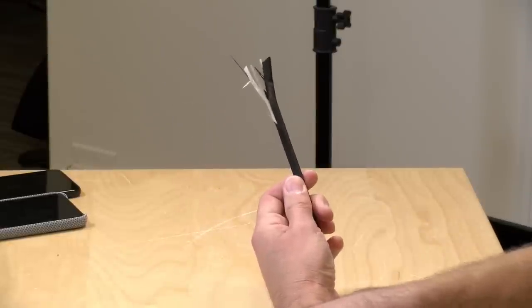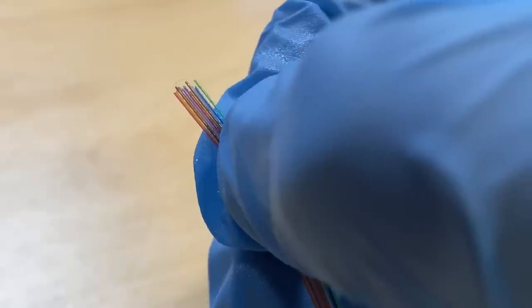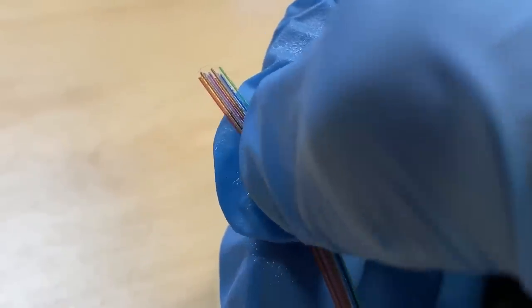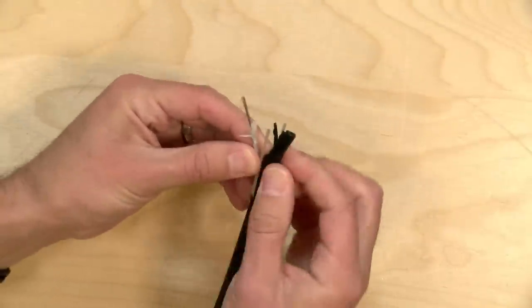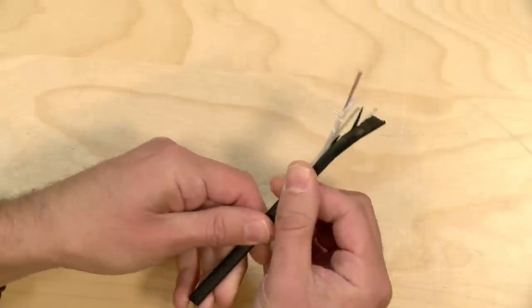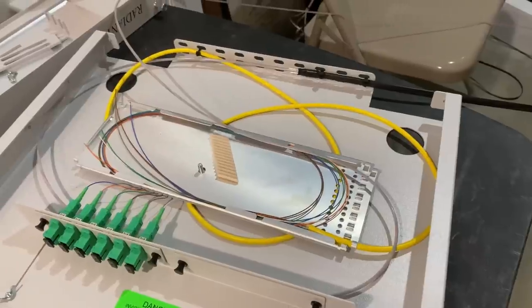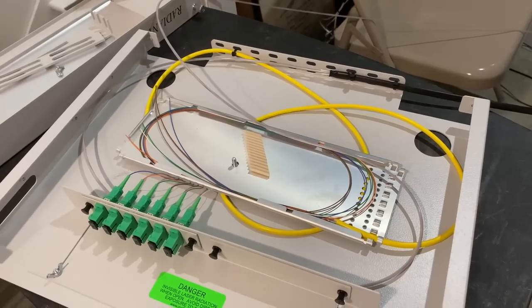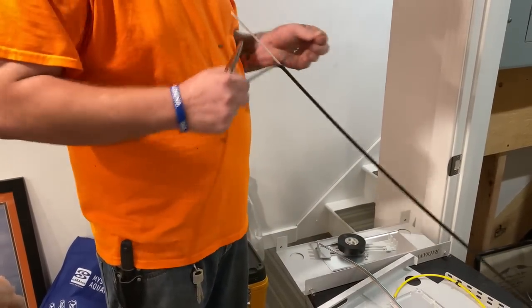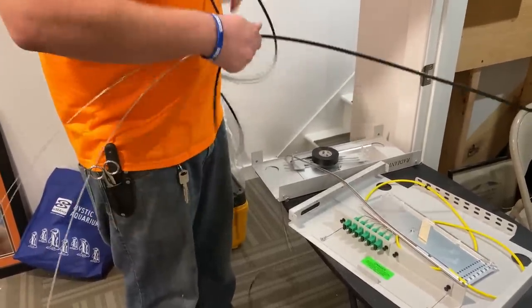So you have to be very careful with it. The cable itself is pretty neat though. What was surprising to me was just how small these little fibers are — I'm using two of these to get three gigabits of data. You could probably get a lot more out of just one of these little fiber strands. The cable actually has a lot to it: you've got the outer sheathing, then two really hard plastic members that give it its rigidity, and the fibers are protected inside a sheath with some lubrication — I was wearing gloves because it was getting all over my hands. Then the fiber splicer came in with a little box to terminate everything, with six connectors — one for each strand of fiber they ran to the pole — and he got the cable prepped for that procedure.